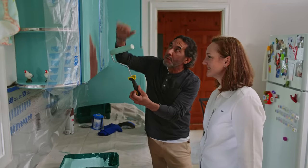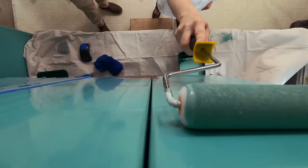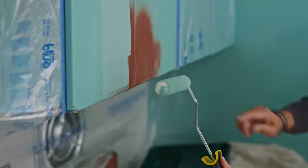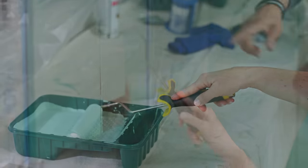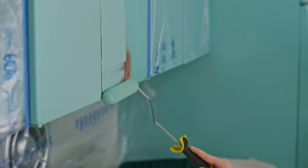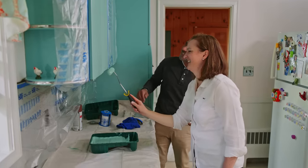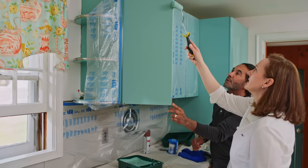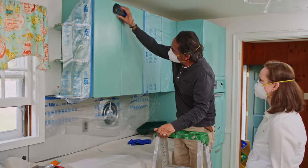Start about three to four inches up, then come right down with the roller and fill the gaps — this way we avoid dripping paint. Overlap by 50% with each pass of the roller. Not only did we match the color perfectly, we also matched the same finish. It's like 1960 again in here. Wow, look at that — you're a pro. You ready to hire me? Absolutely. Now do the edges — bottom first and then the side. We're going to wait about two to three hours for this to dry, then come back and do the same thing.